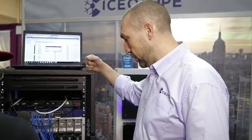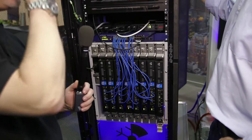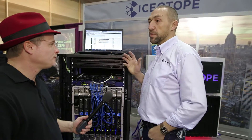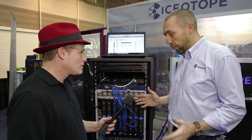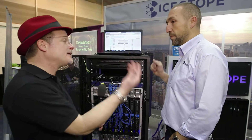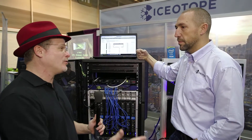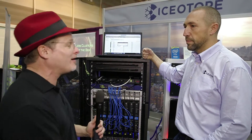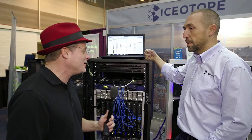What kind of density can you achieve? How much power in a rack can you cool? The system you see here is our prototype — we're releasing our new one this week. We're up to 30 kilowatts in an 800-wide by 1200-deep cabinet, so that's 30 kilowatts in roughly a meter-square footprint. And we've got a roadmap to go to 60 kilowatts. Once you get up into the 60kW realm, that's well beyond the capability of air cooling — somewhere around 45kW you simply cannot move enough air to cool a rack.